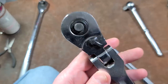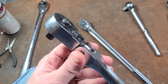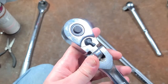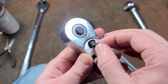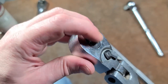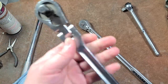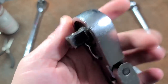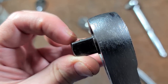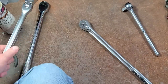A lot of people are familiar with this style. This is probably the best-selling Craftsman, which I call the black switch version. But actually in the old tool store, they have a few of these where the switches are missing — they do fall out. Also, the quick release button was plastic on these; I really don't like that. This is the 44816s, the VVM series, and the ball detent is super shallow — barely holds onto the socket. Maybe it's better on other ones, but I really didn't like that at all.